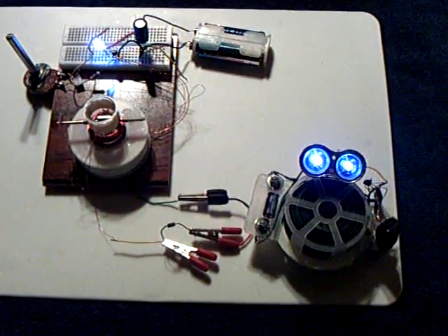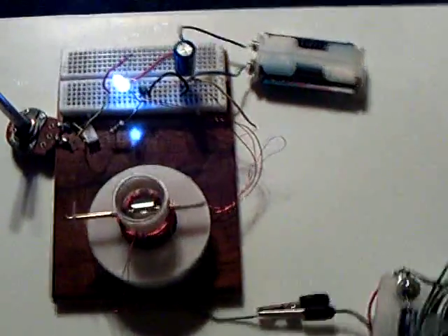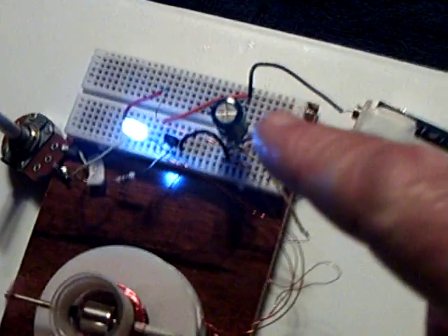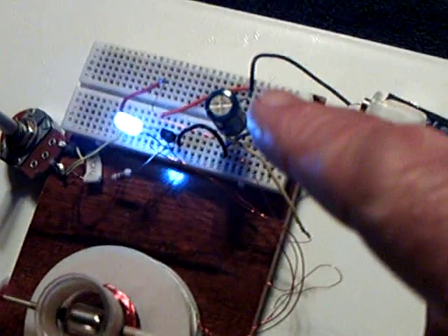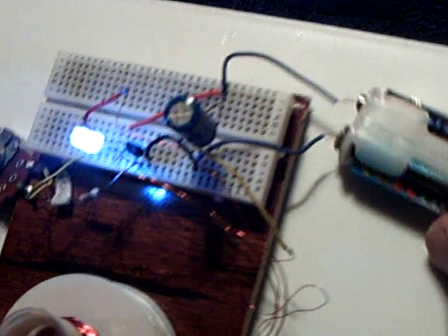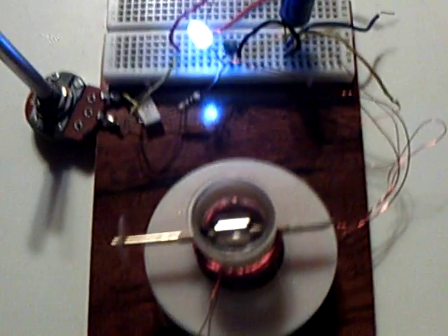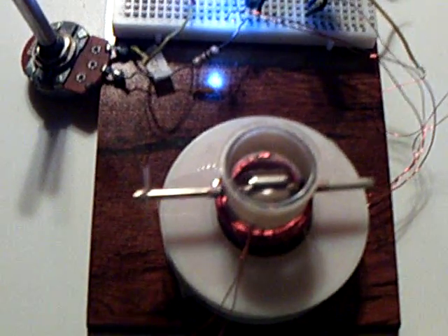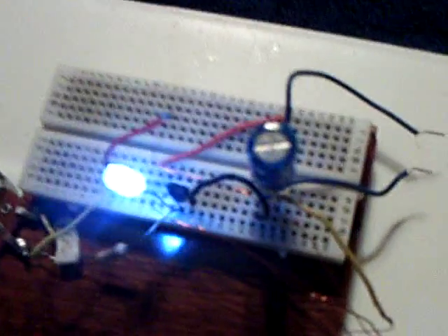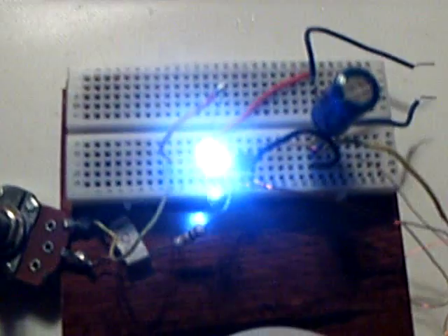I have a new Motor Wars champion. How I'm testing these little motors is with a 5-farad 2.7-volt supercapacitor that I'm slightly overcharging with a 3-volt AA battery pack. I just time how long the little motors will run with the energy stored in that supercapacitor. There's usually an LED on the motor, so there's a load on the system at the same time.